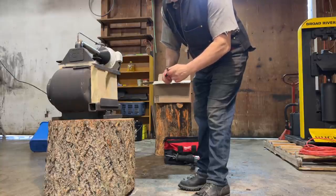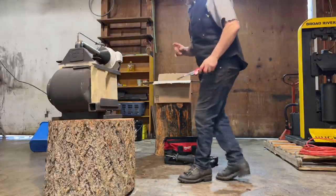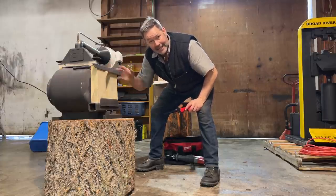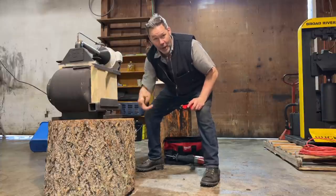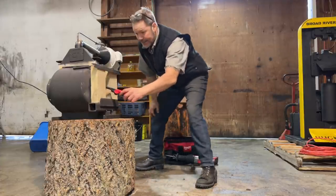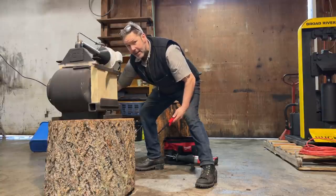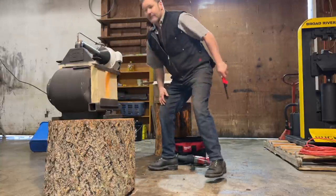This one, it literally just farts. It's empty, I think. I left my other one at home, so I should get another one, but I'm going to try something. This is my starting procedure, friends. I start the fan, but I don't leave it on because it blows the flame out. So in order to get propane into the tank, I turn on the fan, then I turn it off, and with the existing run-on of air, I turn the propane on nice and close, turn, click, boom. I'm talking right in on the flamer. That's just what I do. So we'll do this, watch. Turn this on, listen. Just like that. Then I turn it off, and then I turn the propane on right away. Like that.